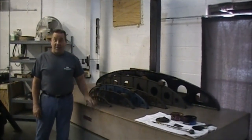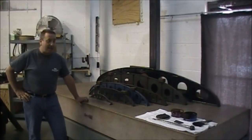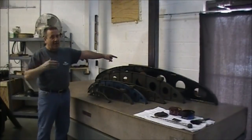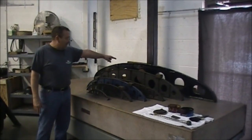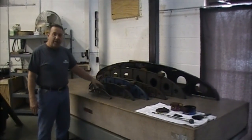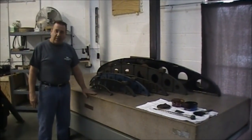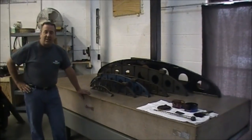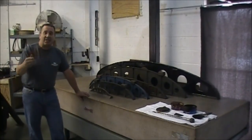The equipment you need — you need several things to do a good scrape job. First of all, you need some straight edges. Back here we have every different size, because the size of the job is the size of the straight edge you have to use. Too many people use the wrong equipment for the wrong job. We've got an eight-foot straight edge, a six-foot, a five-foot, a four-foot, a three-foot, and a foot and a half. This is our bigger plate — it's a 4x10 surface plate, grade A. It does an outstanding job.